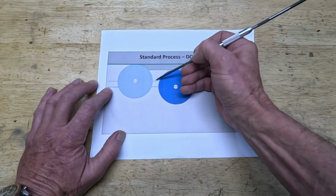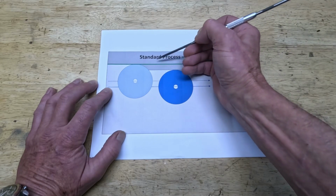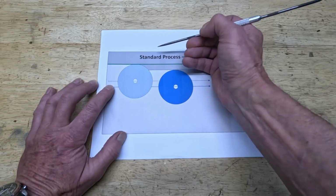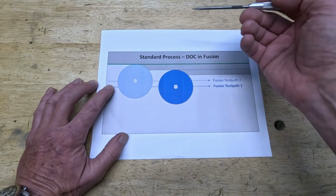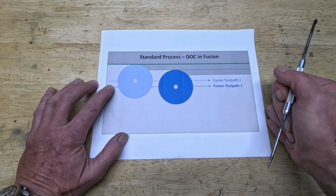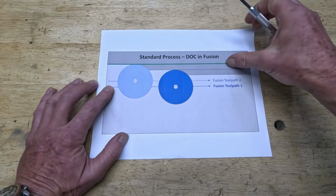You change the tool path according to the difference between the measured thickness and the thickness you want to have eventually. And then you do the same thing, create a CNC file, send it to your machine. And sometimes that might take several steps. And it works, but it is not very efficient. So the process I'm using is a little bit different.